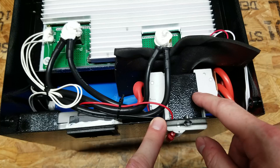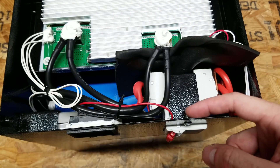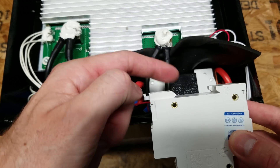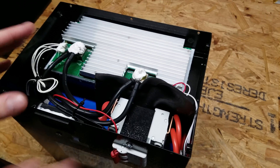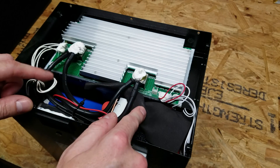This is just a standard DIN breaker and they put a custom piece of metal strapping around the back of it to hold it to the front of the case. The new breaker will fit the same way — it's the same type of DIN rail and exactly the same height. These are standard measurements. It's very important to keep in mind while working on this that all these terminals are live inside even though the breaker is shut off.